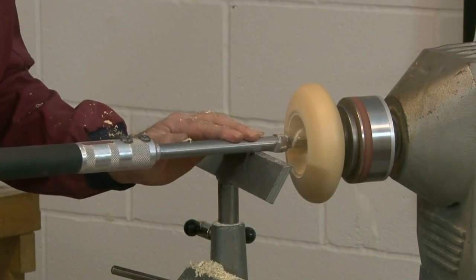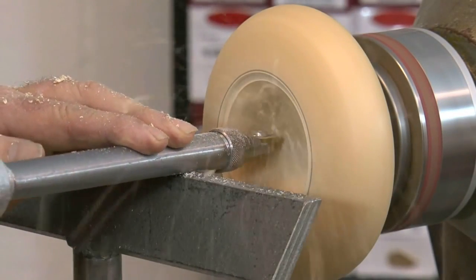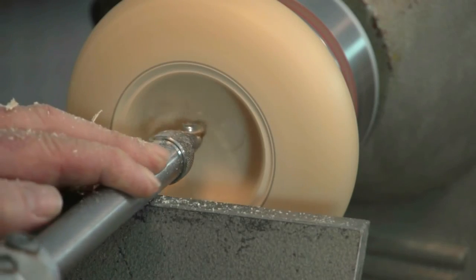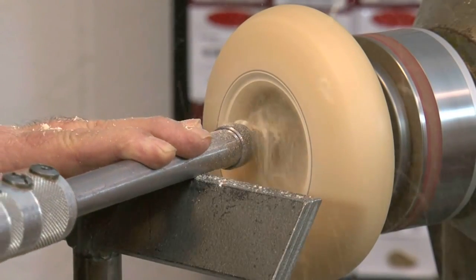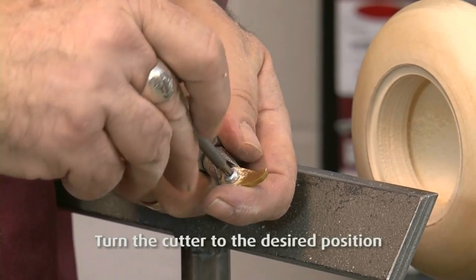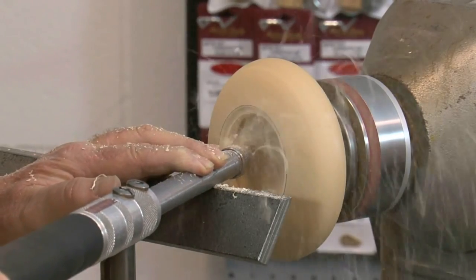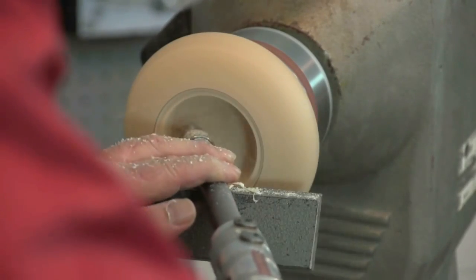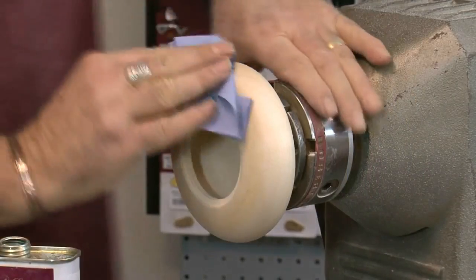As the cutter we are using is high-speed steel and is titanium nitride coated, it has a longevity of edge life but gives a superior finish to the tungsten carbide, as we mentioned before. As we can see, the mushroom tool can access deep under the rim of the bowl. Sand, finish and proudly display.